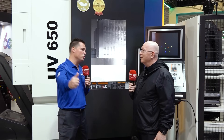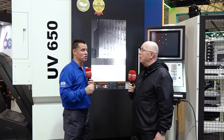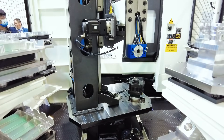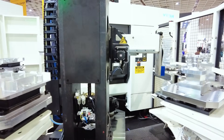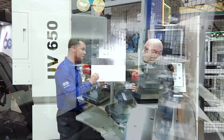There's a topic I have to discuss — going back to what you said about the tools. If I do my math correctly, you mentioned 120 on top of 60, so 180 tools. In a machine shop, I've been that machinist who wanted a done-in-one scenario, a complex part finished, and I didn't have enough tools in my tool changer. Regardless of the capability of my machine, I had to take it out or slow down, pop different tools in, re-probe them. The ability to have enough tools for redundancy or for a high-mix situation with all those pallets is one of the keys that's sometimes overlooked.